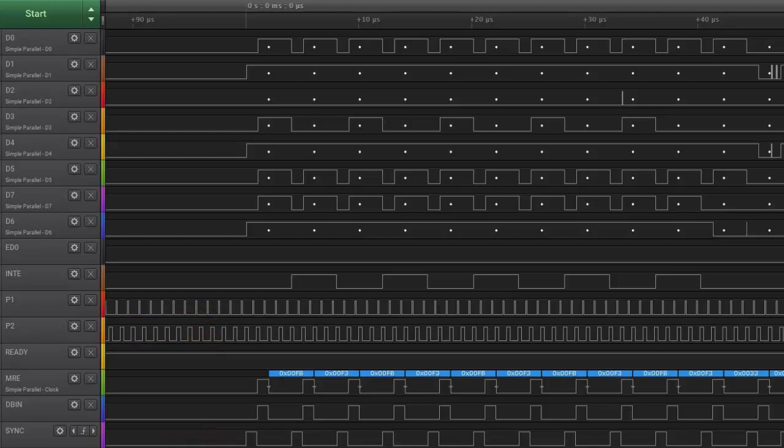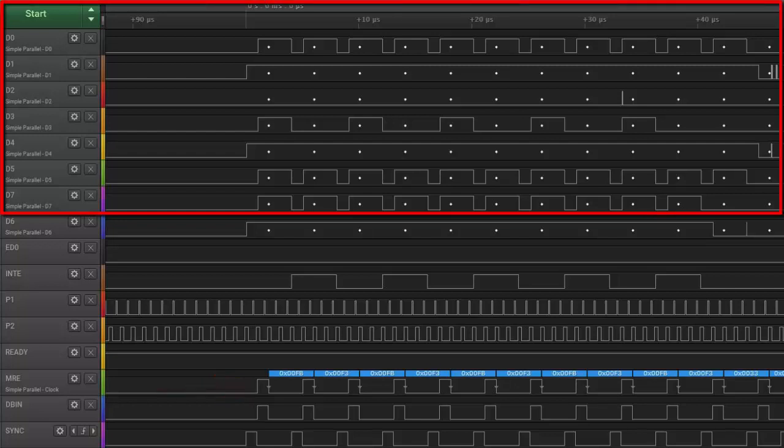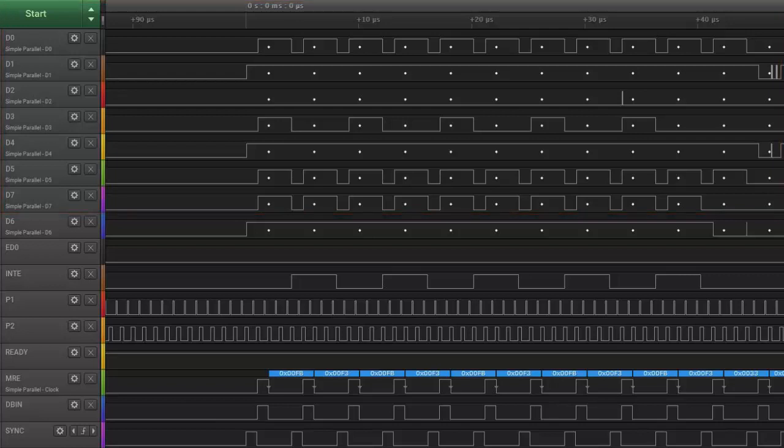Here's my memory read, and these are my data bus up here at the top. So you can see it was getting first instruction, which is an FB. FB's enable interrupt, and pin 9 here is my interrupt signal. So you can see here's my enable interrupt, disable interrupt, enable, disable, do that 5 times, and then I have a loop that goes back to the beginning.